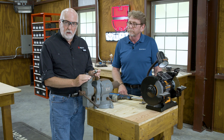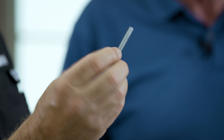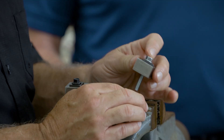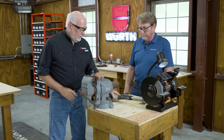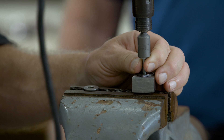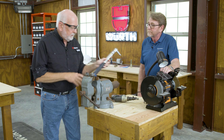What we have here is a standard generic thread rolling screw used in industry everywhere — very common part, zinc plated and waxed. We're going to run that into this unthreaded weld nut and see how that performs. Then we will also run the TapTite Pro in the exact same assembly. First, I'll take my screw gun and run this down to seat the screw, then finish it off by hand.